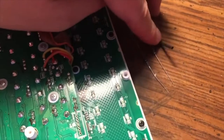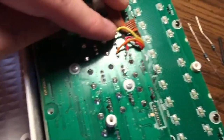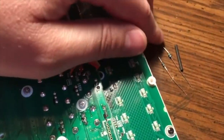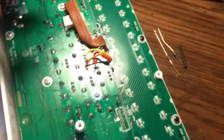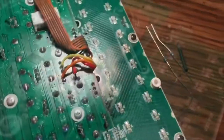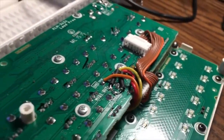Pay me! These two resistors are going into this heat shrink and then going here, so rest assured there will be resistors. I'm using 47 ohms like Yamaha — some people use 220 — either way it's gonna protect the input. It can work without them, but protection, you know. Nice and clean.